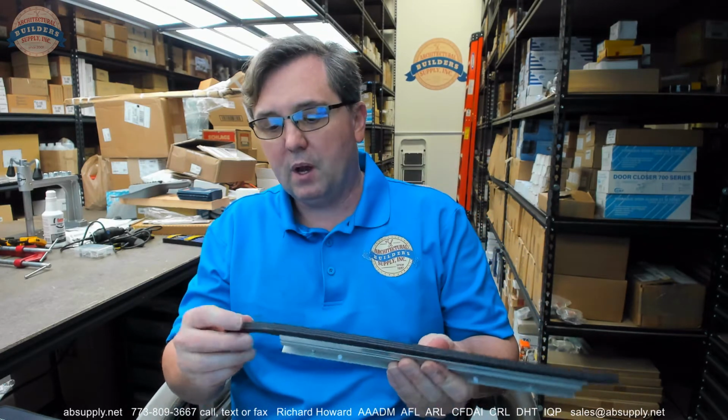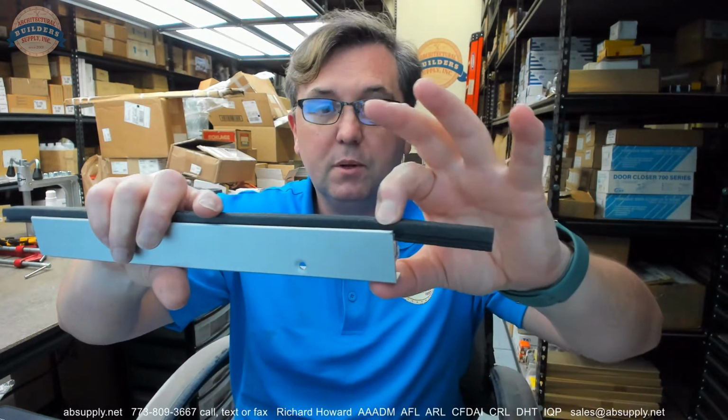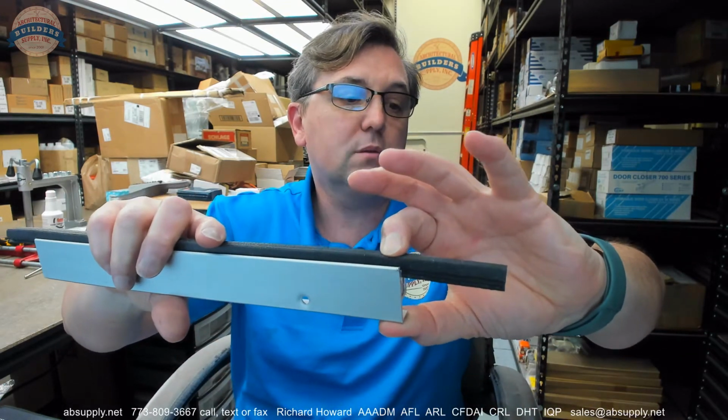There are two types of neoprene. There's closed cell and then open cell. Open cell would be better for acoustical attenuation, but wouldn't be good for keeping water out. Closed cell neoprene would smell like car tire. It's quite effective, although it's substantially less flexible. So silicone's really great for gasketing.